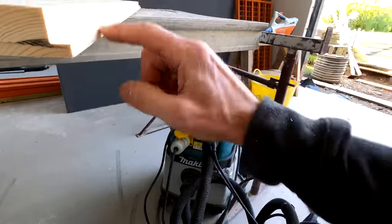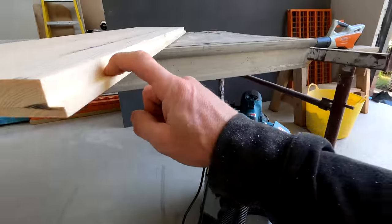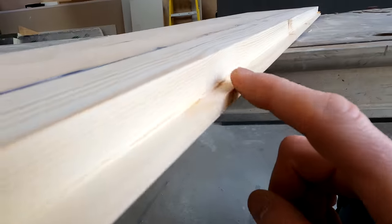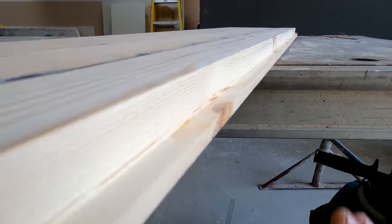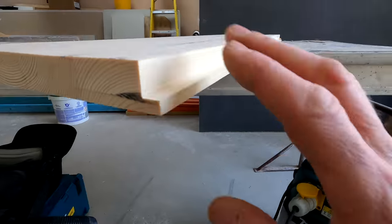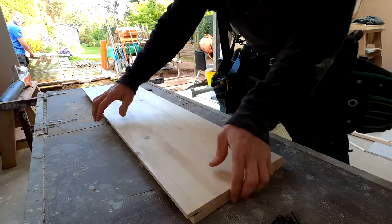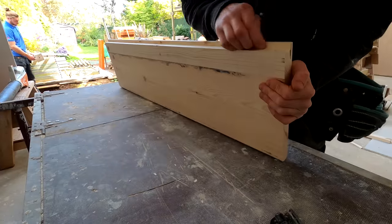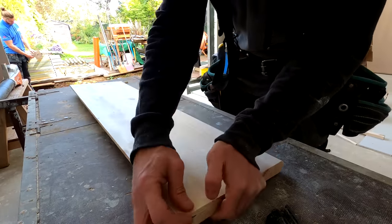Now I've cut my lip using the table saw — just basically got it set up to cut this little detail out. All I need to do now is just finely tune this up to give us a nice sharp edge just where the blade didn't quite meet when I came back over with my other cut. Then once that's done we can start getting our horns marked out and cut. I've got my recess sorted, that's all cleaned off nicely with my chisel, so that will now sit in the reveal of the window.